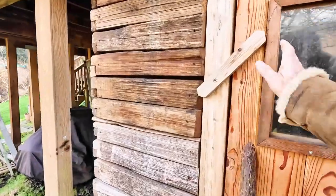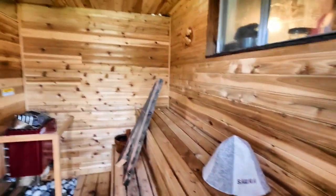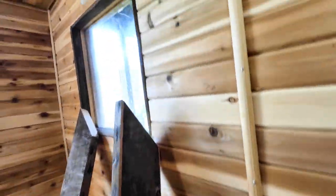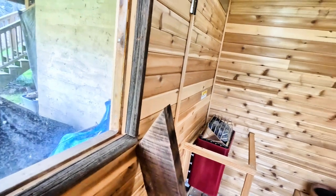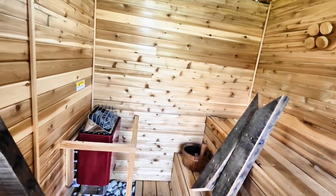I have one more window of frames to do, and I'm going to put them in my sauna. It can be wet or dry. It's going to be dry for this purpose. These are my next boards. So I'm going to run a few cycles in the sauna to start drying them out. Then I'll probably just put them in the house for at least a week or two. So this is my makeshift kiln for wood.